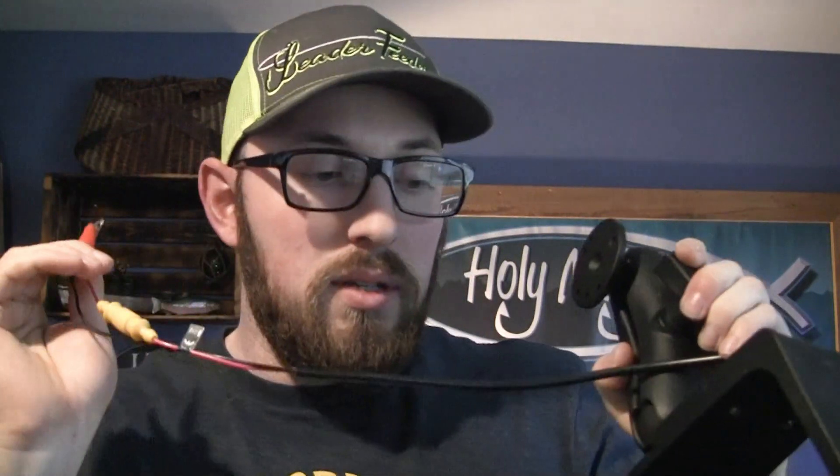My ocean boat doesn't have the greatest chart plotter, so I wanted to find a way to utilize the benefits of this newer unit in my salt boat as well. The first thing I needed to do — and it's totally doable — I already have the RAM mount. I got an additional inch-and-a-half round ball head to mount inside the ocean boat so I can have this unit underneath. You also need an additional power cord, so thanks to Amazon I was able to get one. I've mounted it to go straight to a battery terminal with alligator clips. Already tested it out, it works great.